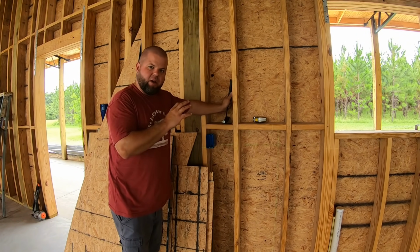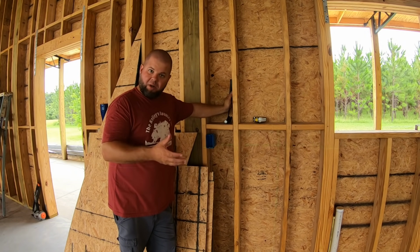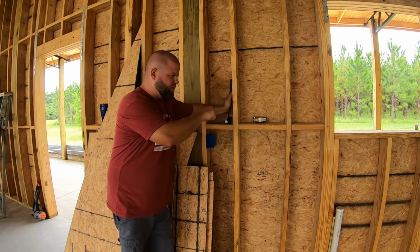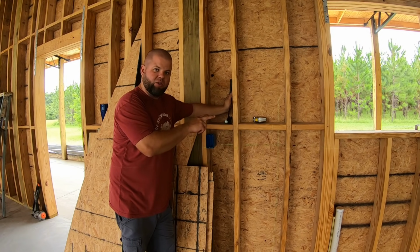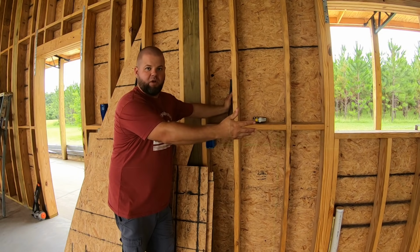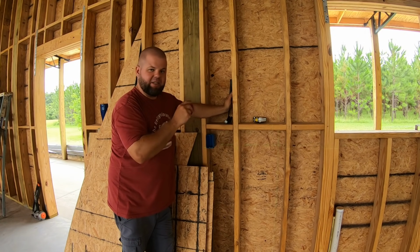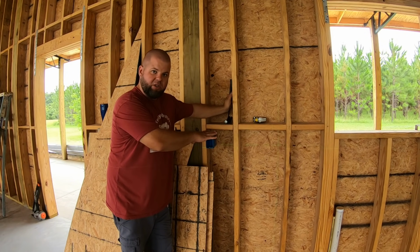So my plan is, because I know kitchen outlets, especially countertop outlets, can get used by some pretty power intensive appliances, Instapots, crock pots, things like that, I'm going to run a separate circuit to every other outlet that I put in. That way we have 2 separate circuits going just to the countertop outlets, and then I'll put an additional one for the dishwasher and things like microwave that are very power hungry and kind of need their own dedicated outlet. But I wanted to make sure that I had at least 2 20-amp, 12-gauge circuits running up here to these countertop outlets.